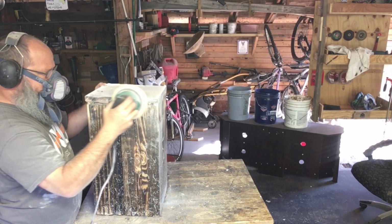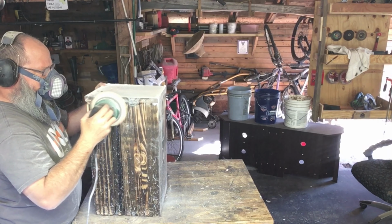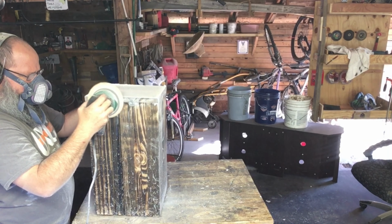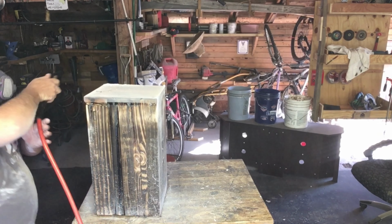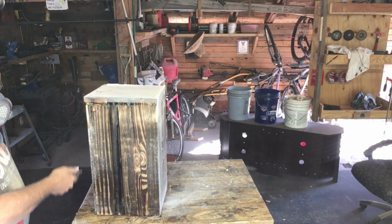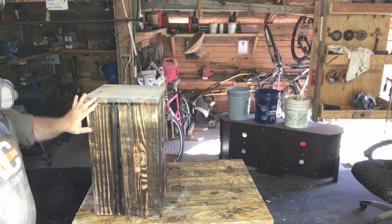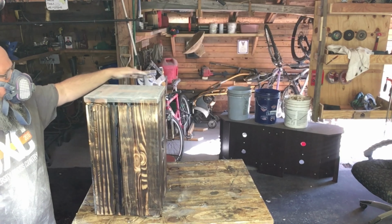and now I've got the 80 grit sandpaper on the sander, and I'm trying to sand it down to the final dimensions where it's flush to the side. The only problem with that is then I do end up hitting the side of the end table, the wood, and messing with epoxy, cutting it and sanding it, it does make quite a mess. As you can see there, I'm just trying to clean off the work surface, and I'm just trying to feel it there and see what I'm working with.